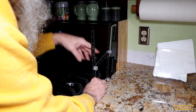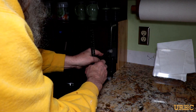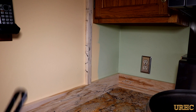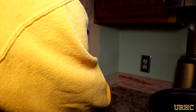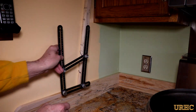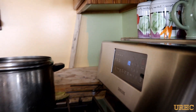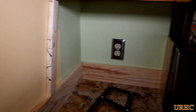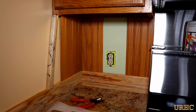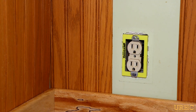On the ends, I was originally going to put a radius on there, but after looking at it I decided to match the angle of the stove to make everything look like it went together and look a little cleaner. I set an angle gauge up against the front panel of the stove, set up my angles, and you can see it's a perfect match. I used a Kreg pocket screw to attach the upright trim piece, and everything was rabbeted out to hold the wainscot behind it.